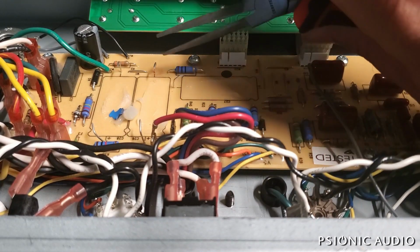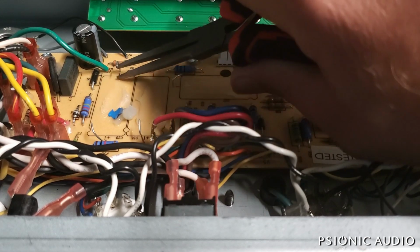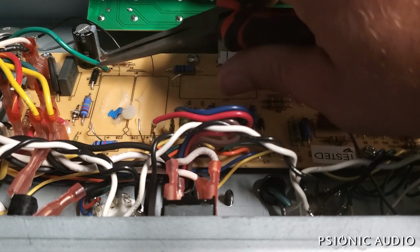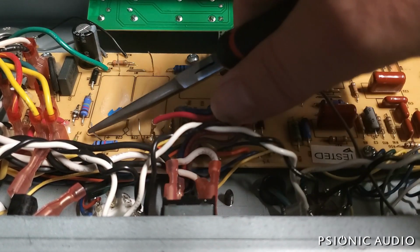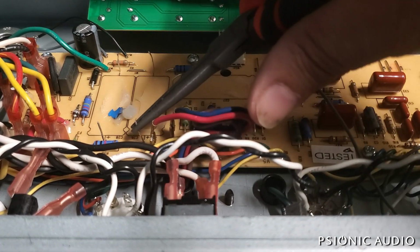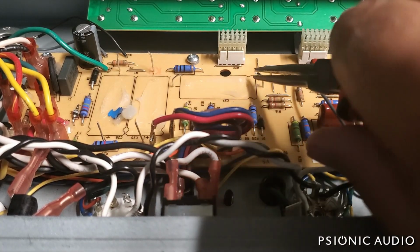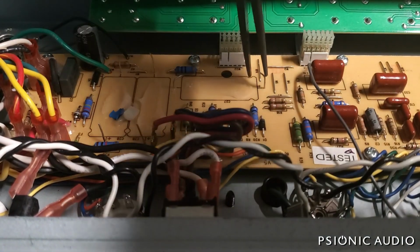All right, well, I've got the board still in place. I like to straighten these leads so that later I can push them down and they will come out on the other side of the board without any mechanical stress or tearing the very thin copper on the pads. I do that to all 4 filter caps.